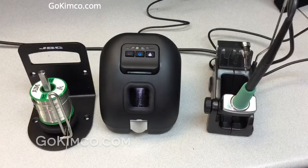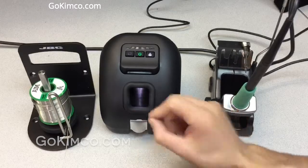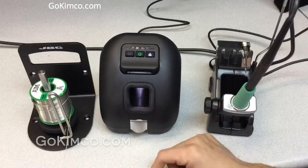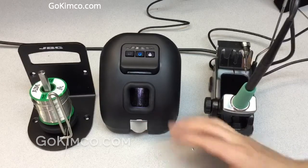This unit is great for saving tip life. The stress on the tip is barely one second in and out. Keep in mind — try to go in and out quickly. If you're in there more than three or four seconds, you're going to oxidize the little brushes and they're going to solidify and crack the tip. Good methodology is really important.